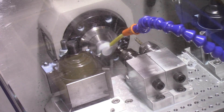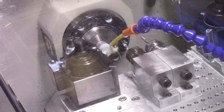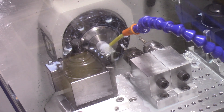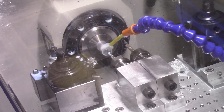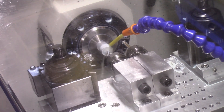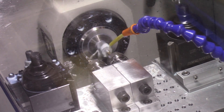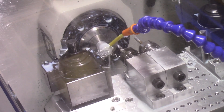Here is the final machining of the ends of the bars. Step one is facing off the bar, using roughing passes and a final pass at a slower speed to get a smoother surface. Step two, I use a number 21 drill to drill one half inch into the end of the bar. Step three, I use a 10-32 tap to tap the end of the bar. And in step four, we round off the ends of the bars.